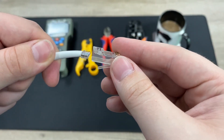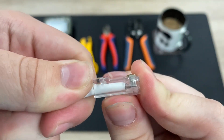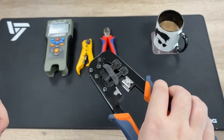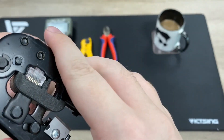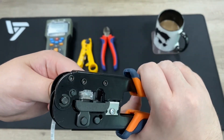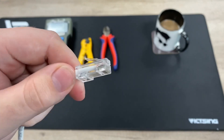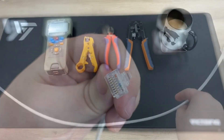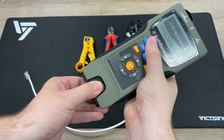Make sure that if you have the lip facing up, the clip of the RJ45 is pointing downwards. Slide it into the RJ45 and you'll see it click into place. Then put it into your crimp tool through the eight-piece slot, make sure it clicks into place, and give it a few presses to make sure it's nice and tight. The benefit of the two-piece RJ45 is that you could assess whether the cores were in the right direction using the guide before crimping, so you can be very confident the connection will be perfect.